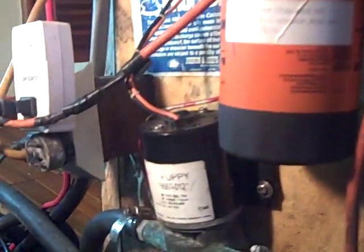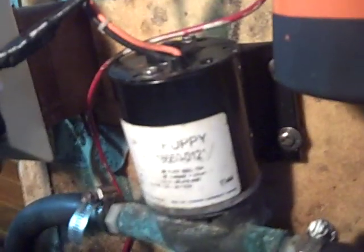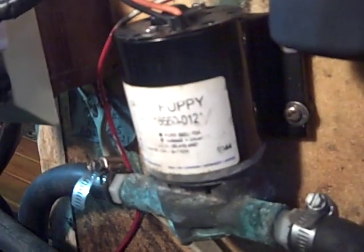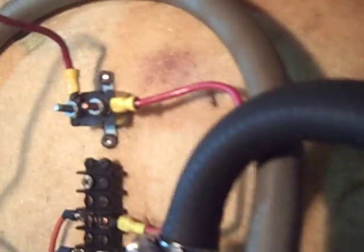Here's the reason for putting it in — and there are the fuse blocks for it, right there, fitted with one of those handy-dandy resettable fuses. The input to the electric water pump comes from the water strainer over there. It comes in here and actually replaces the mechanical water pump.